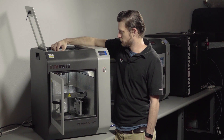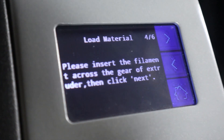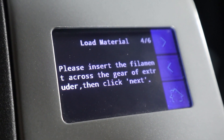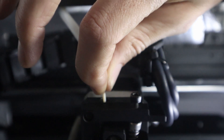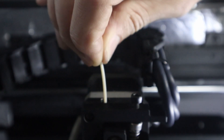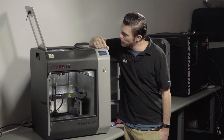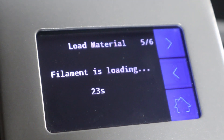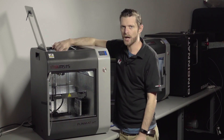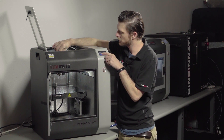It is now at stage four of six, the load material section. If I hold on to the filament right here — you can see it very slowly putting the filament into the hotend. Now that we can see it's being fed through the gears properly, we move on to step five, where it takes 30 seconds and actually moves some material. Once you see filament coming out of the nozzle, you've loaded your filament properly and can begin printing your part.